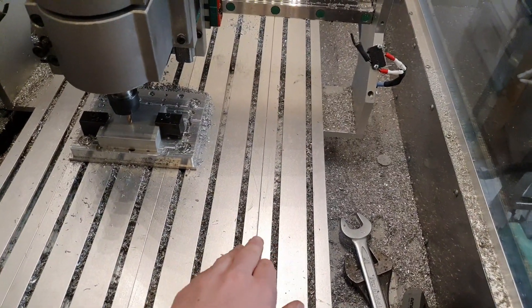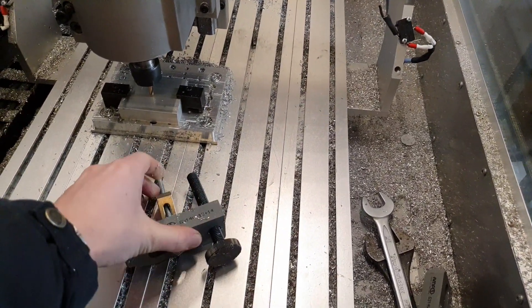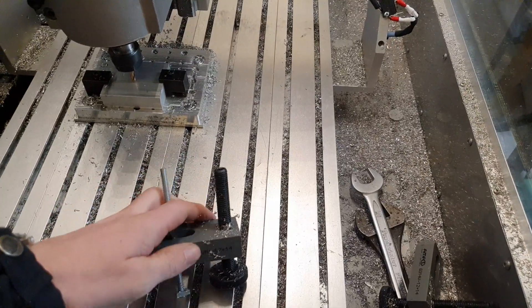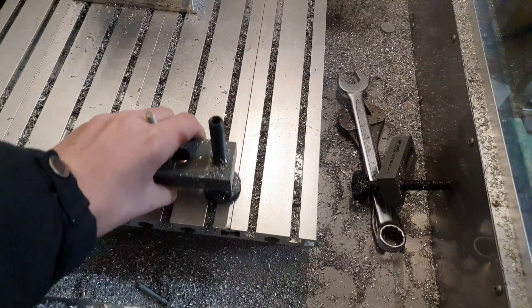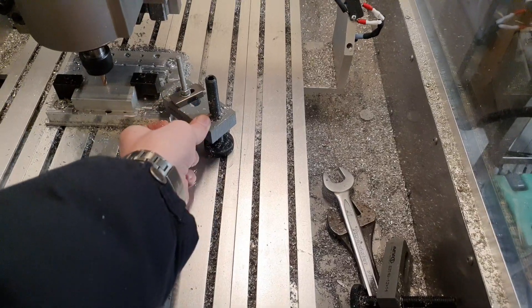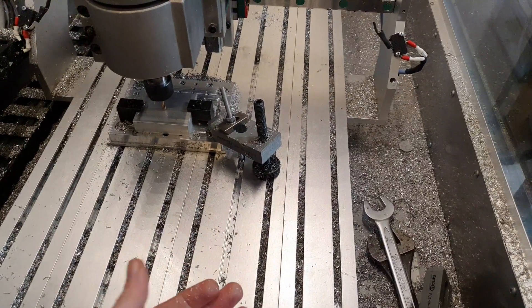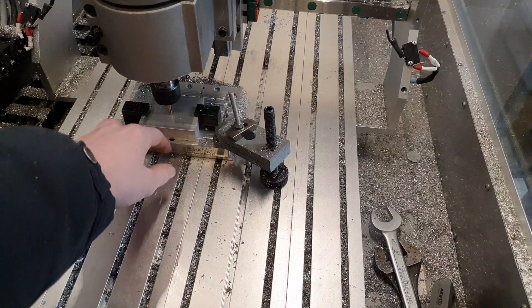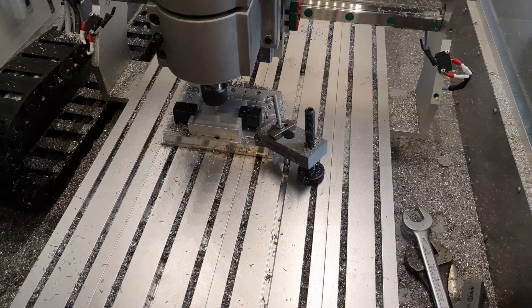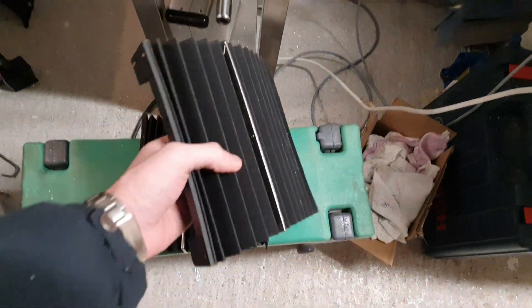They are all way too soft. I did buy some very nice stuff here for work holding that works super smooth, but the problem is that when tightening here — I don't even have to tighten super hard — the aluminium just flexes. So hopefully I will have money pretty soon to add a solid piece of aluminium here.